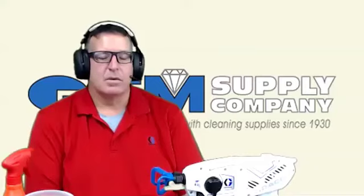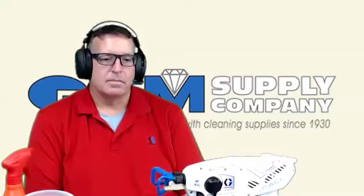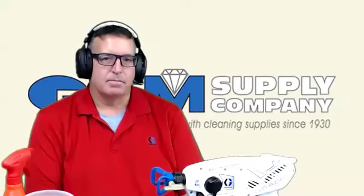Yeah, absolutely. Don't hesitate. Kevin and I are here to help. I think the primary issue just getting started is the priming, making sure there's no foam. Once we're past that, make sure that we're not running that pump without liquid going through it. We don't want that pump to overheat and burn up. But they're pretty easy machines after that, and they are durable.